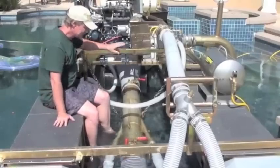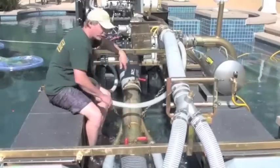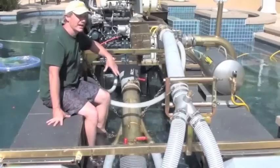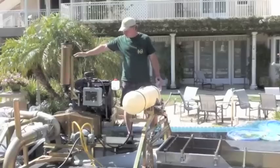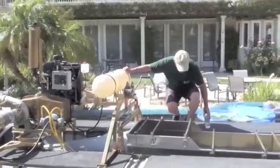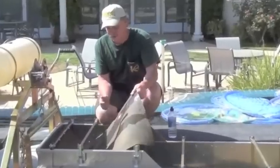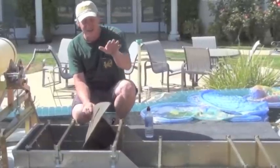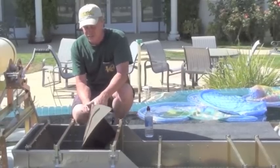You'll notice this jet is not quite like our typical power jets. You're going to see some big heavy steel metal plates on here — we call it an Africanized jet. This thing is designed to last season after season in really harsh terrain. The material comes through the suction hose, travels through the power jet, into your jet flare, and then everything hits what's called an Alaskan damper or rubber damper. The material comes across this heavy weight — it's almost three-eighths of an inch thick — and it knocks down the surface tension of the water, helps prevent bubble or fine gold flotation, and also helps disperse the energy.